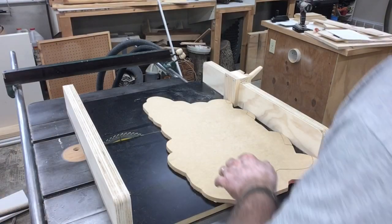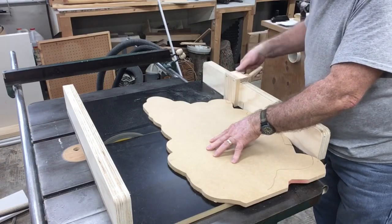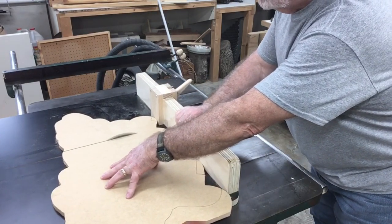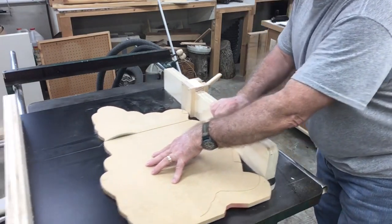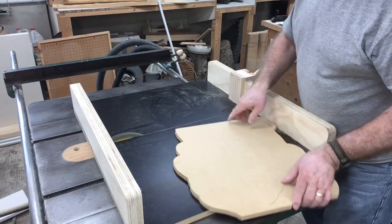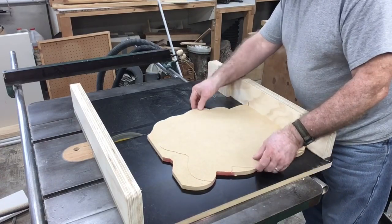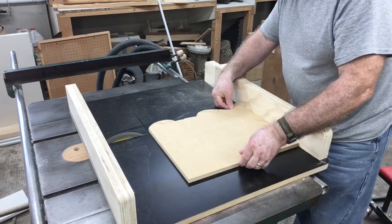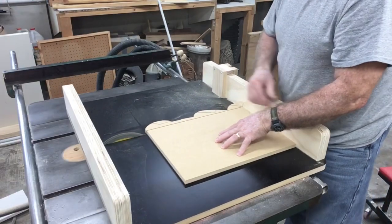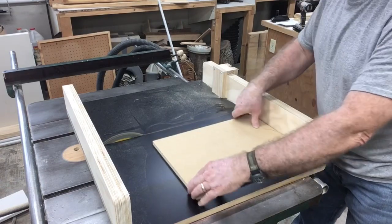All of the adapters that I have were designed in Easel, and when I went to do the carving today, my computer and Easel did not get along. So I went out, found another piece of the 1/2 inch MDF, and decided to cut it square, and used a V-carve to design the same exact adapters and carve it on the new machine. The nice thing is I did find a piece that was large enough that I could cut out all of the adapters that I need at one time, rather than having to come back for a second carving.